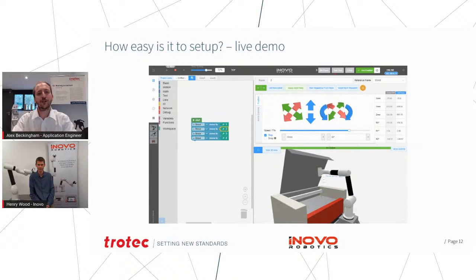Okay, so I'm just going to make a few pointers about that application. One of the things, when you're working with this kind of application on something like the Speedy 400, is that you want to try and make the job as wide as possible. So all you'd really want to do from the base demonstration we showed you there is have multiple jigs, and then that way you could have the robot load multiple jigs into the bed so you can make full use of the actual working area itself.